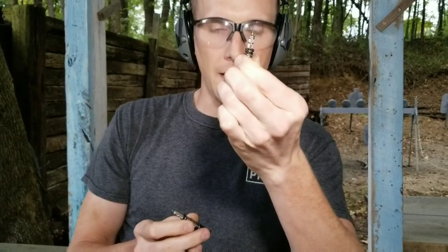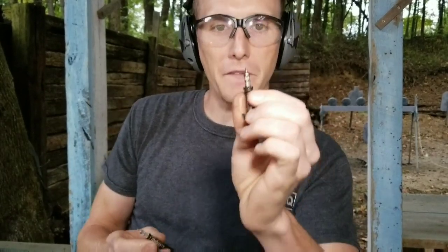So if this were the bottom of the gun and this were the barrel and we're shooting that way, the tip of the striker is angled like this. That will aid in reducing striker drag or primer drag, depending upon how you want to define it. But the 365 does have a symmetrical tip.